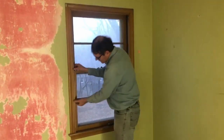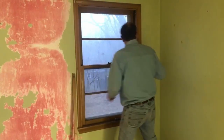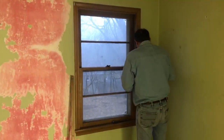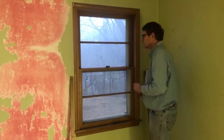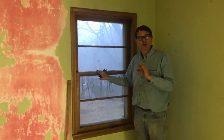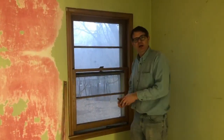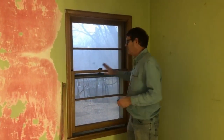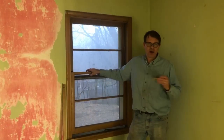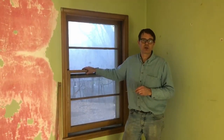I've already taken the time to release these front molding pieces here — I'm going to set them to the side. You don't actually need to take off the upper piece. Now under normal circumstances, if you had a wood parting strip, you would just reach in, pull it out, and you'd be able to take the sash cords off. But that's not how this window is made — this window has metal parting strips. Come on over and let me show you how to take the metal parting strips out.